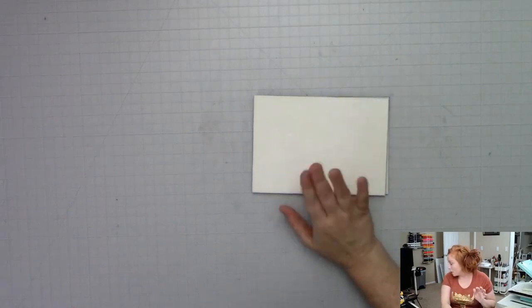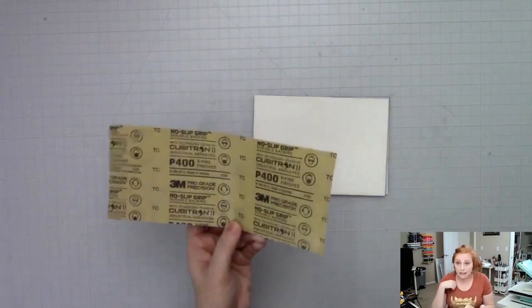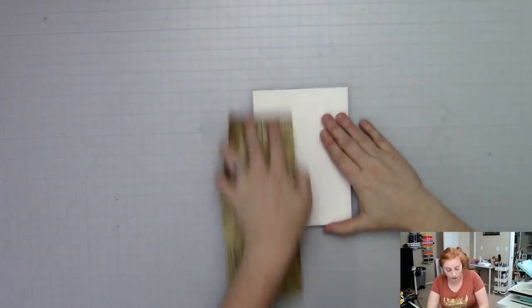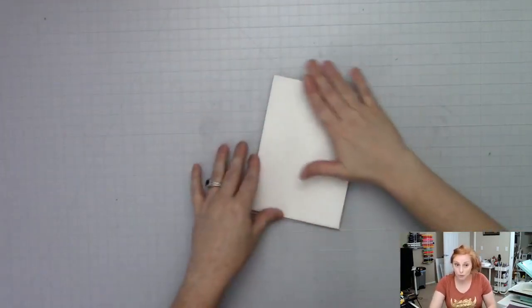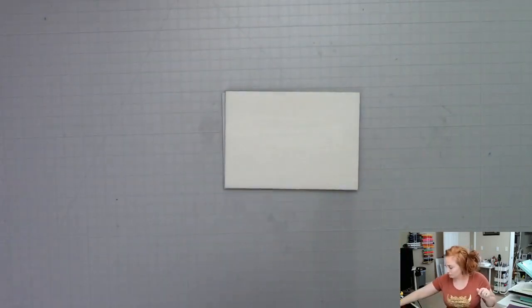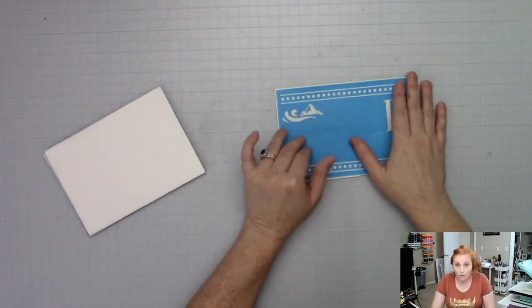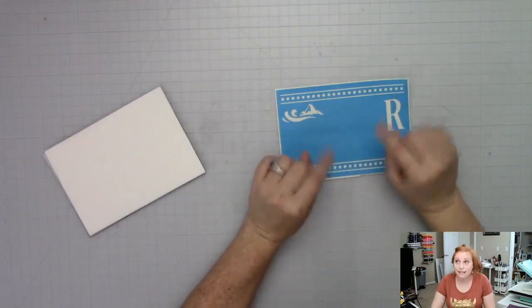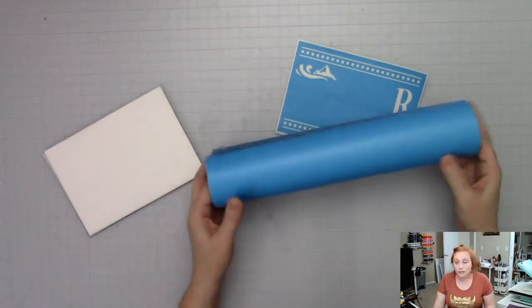When you have finished your last layer of paint and the paint's completely dry, I like to take a really fine grit sandpaper - this is a 400 - and just lightly go over it. That just smooths out this very last layer so it is super duper smooth, ready for your stencil application, which I have already cut with my Cameo 4 in Oramask 813. This is a stencil material and it comes in rolls like this, or you can get them in sheets.